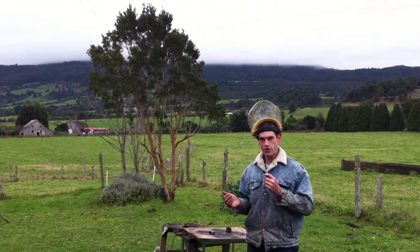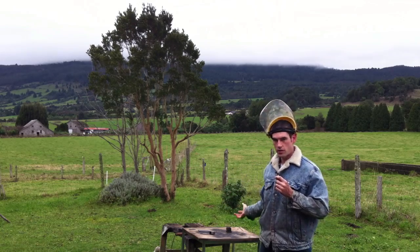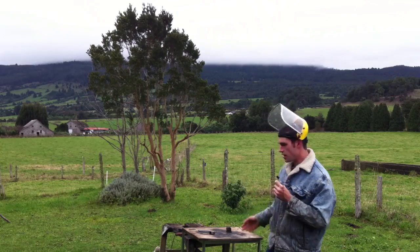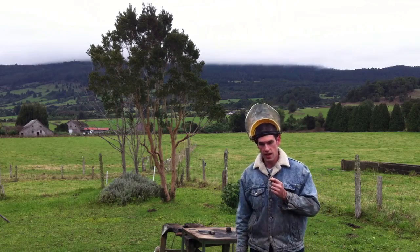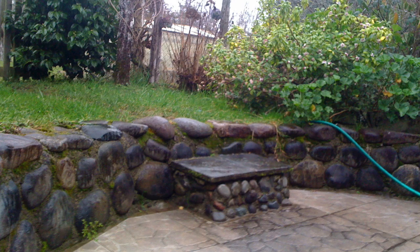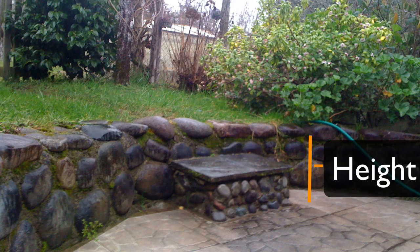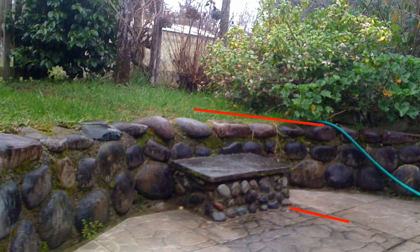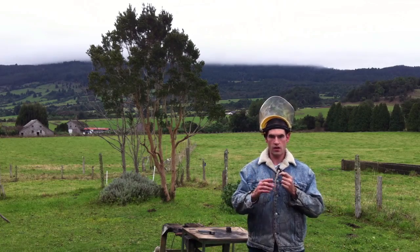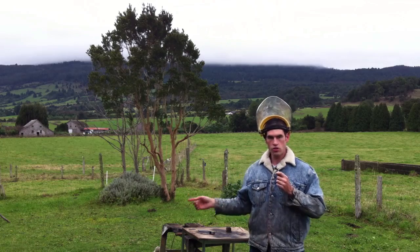First off, I have to go over the information that I have designed up in the computer. Also, I have to get everything laid out on the table, and I have to make the cuts that I have. For instance, where we were going to put the handrail going up the steps, I measured out the height difference between the upper plane and the starting plane or the lower plane. And then I also knew the distance between the handrail uprights, and I knew the total length of the handrail.